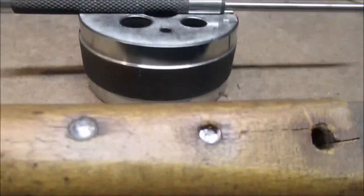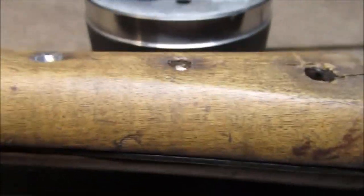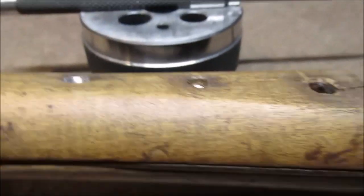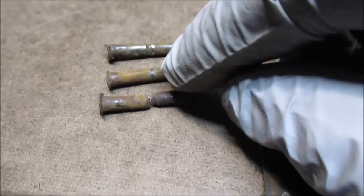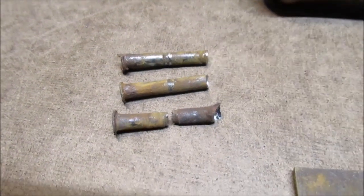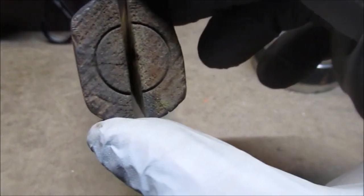Make a dimple with the Dremel, then take your drill bit about that size - don't get too big or you'll chew into the wood. I went a little bigger with the drill bit and decided to drill these out and put quarter-inch brass pins in here so it looks good. Thanks to the bench block and two different size punches - look at this: the first pin wobbled so much it broke in half when I was trying to drive it out. That's how many years it wobbled. I believe this thing is a hundred years old, early nineteen-hundreds.